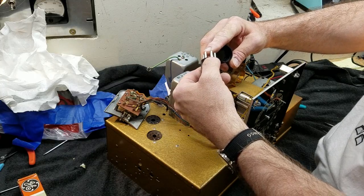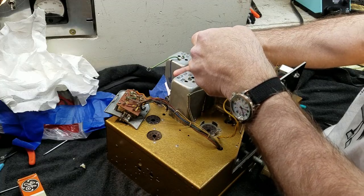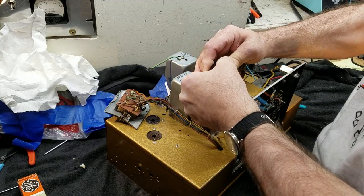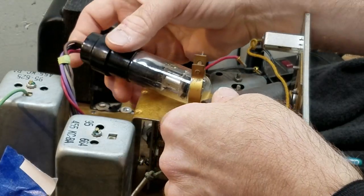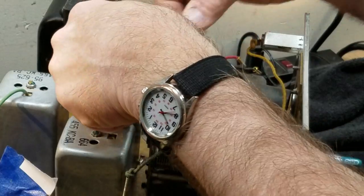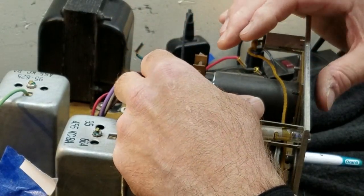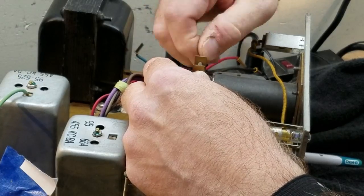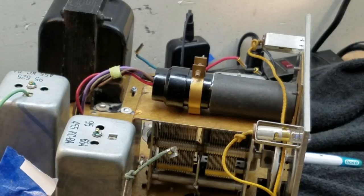The large pins are the heater pins — those are the two wires that needed the help. Let's go ahead and push that baby home. What you do is slip the eye tube right through here, and you don't worry about which way is up until later, because you're going to have to turn it on to see to make it perfect anyway. It goes through this little clamp, then slides through this cardboard tube all the way, and the plastic base of the tube is what gets clamped in that clamp. You push it right up against the opening in the steel, and I don't tighten it real tight, but I don't want it falling out if I turn the chassis over. Nothing to it, guys.